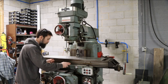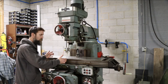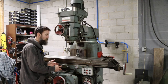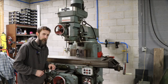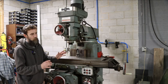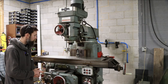The problem with this machine is that the saddle and the knee ways are in really poor condition — got some heavy scoring between these two. I think that was caused by lack of oiling or the oiler stopping up. The plan for the repair is to strip this down, send the bare knee casting and saddle casting to Cache Masters in Minnesota, have them re-grind the knee and potentially re-grind and Turcite the bottom of the saddle and scrape it back in true. If that's all this machine needs, I'll be able to use it from now on — put a DRO on it and it'll be a nice machine. But if I run into any other major issues, I probably won't fix it.